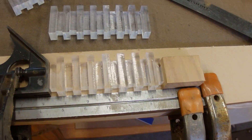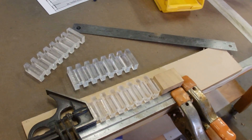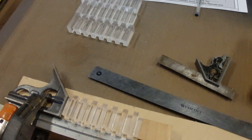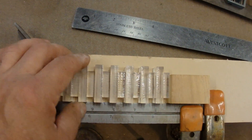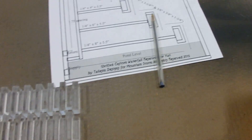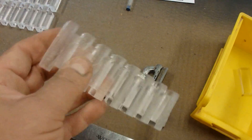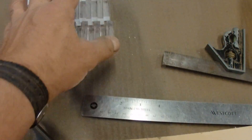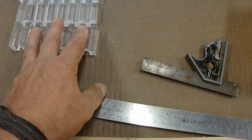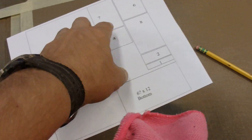I started on the alternate pattern one and I've got one more of those to make. Then I'll dress the back of them, glue them to a ledge, and do the other operations. They look really cool — you can see the staggered thing going on. The next step is to flatten the back; it's got to be kept perpendicular to the side, and it's got to be perfect to fit inside a waterproof box. Once I have all three the same width — one is about a 30th of an inch big so I'll have to run it down — then I'll know what size to make all my internal parts.